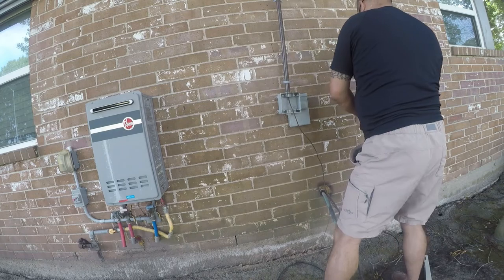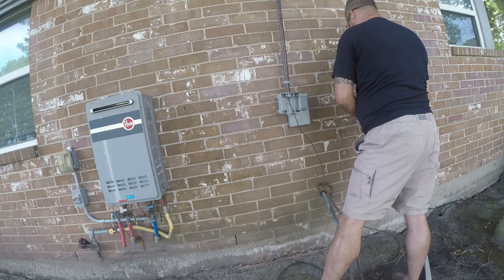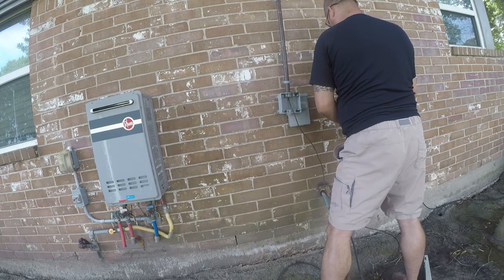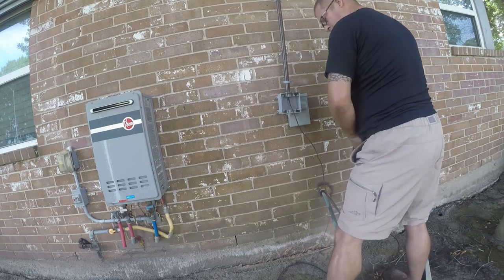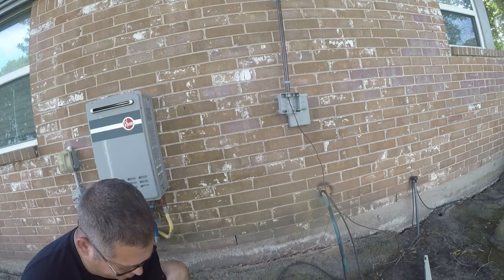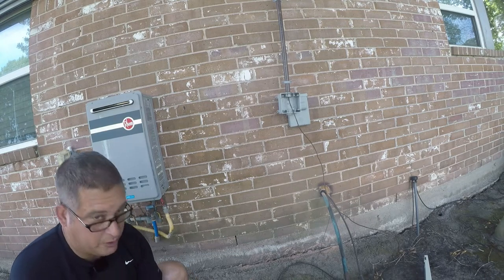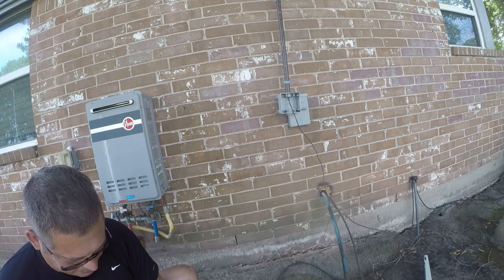These are very soft bricks, but it doesn't matter, it'll do the job. Don't over drill them. You do want to set up your screws so that it is a fairly straight shot to install. What I mean by setup is, go ahead and put the washers on them. It's just less to mess with when you're trying to hold it up.